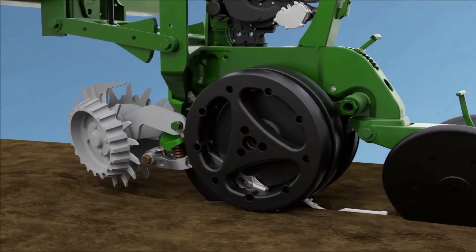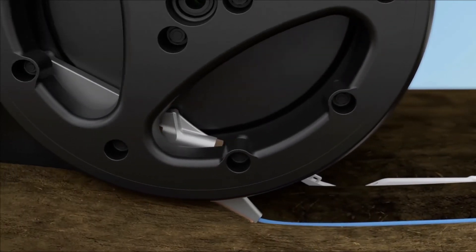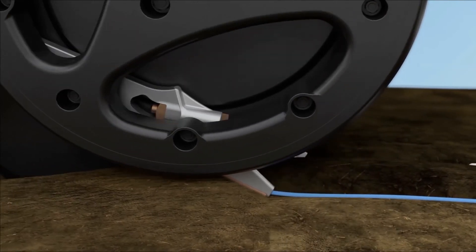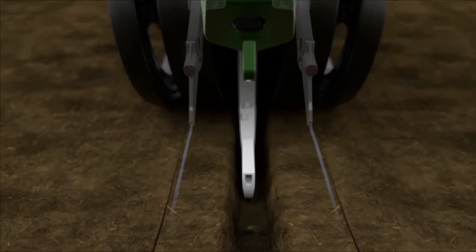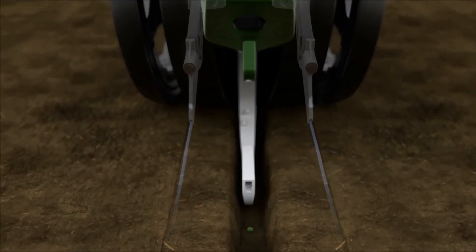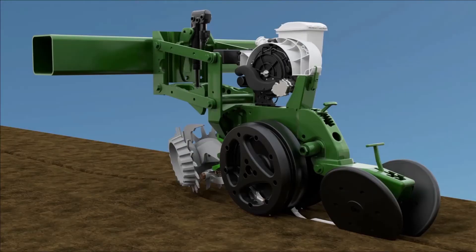As a refresher, this is our Conceal unit — here's a little video of a John Deere row unit. You can see that knife applying about an inch and a half deep. This is not designed to go four inches in depth like many two-by-two applications; it's a shallow application. You can see the furrow being created to plant the seed, and then on each side, three inches away at that inch-and-a-half depth, is where we're making our treatment. We're studying whether it's better to put nitrogen on one side or both sides.